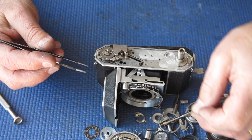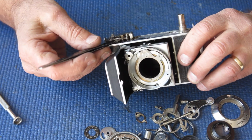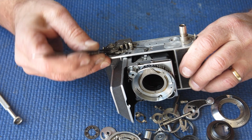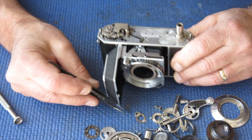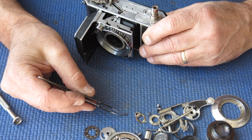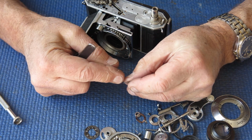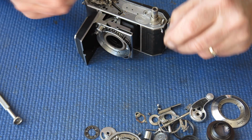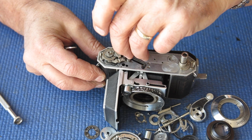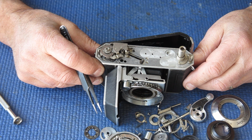That's the wrong spring. The spring that's fitted here is the one that should be underneath this piece here. The two springs are almost identical, but the larger diameter spring, which is in this one in this case, has had the ends cut off it in order to shorten it. It's the wrong spring for this job, and you can tell because it has to be forced down the tube. The correct spring, of course, is just a neat fit.